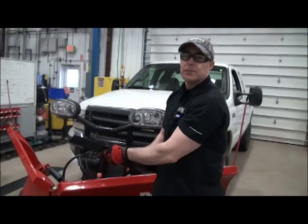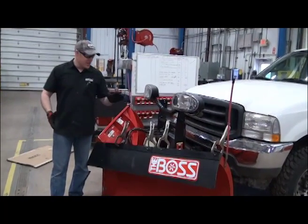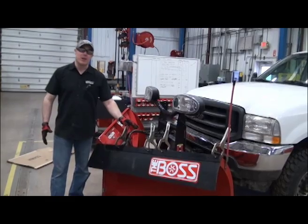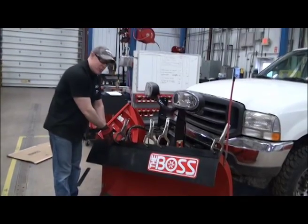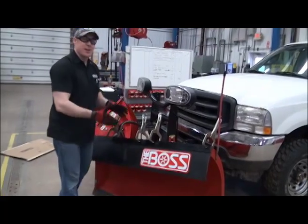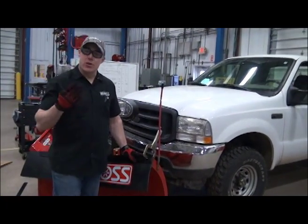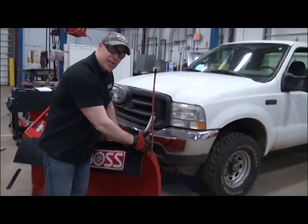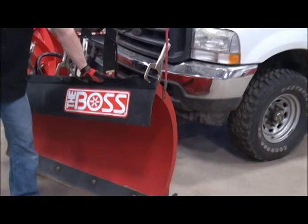All right, let's get started. Now, after we've got our strapping cut, this is where the vice grips come in handy. I basically put the belting up in position, put my metal straps in place, and using the clamps, I have it temporarily located on the blade. Now, the points that you want to make sure are even are, of course, with the edge of the blade itself and along the top edge. This is mainly for aesthetics, but you want it to look good, right?